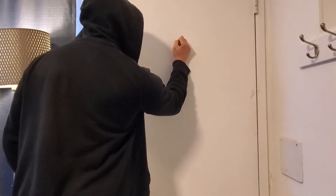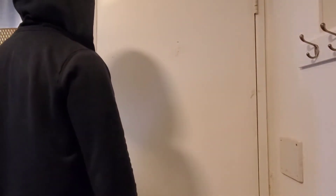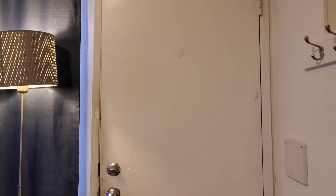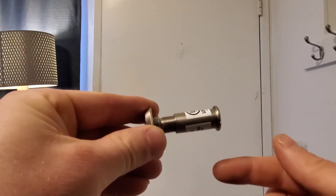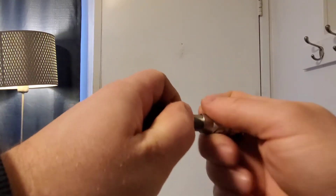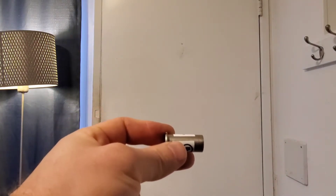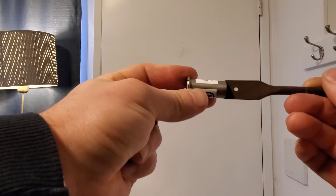So that is 5 foot 3 right there. Now I'm going to take my 9/16 drill bit and drill the hole. This is how the viewer works — when you unthread it, it opens, and as you tighten it, that's what clamps inside the door. We have to drill the hole for this end because it is bigger, so always check before you drill that your bit is going to be big enough — and as you can see, it is just big enough.